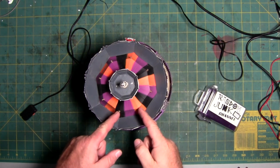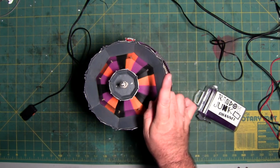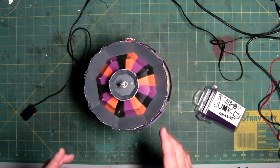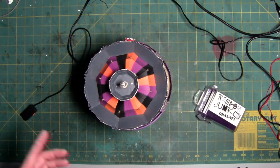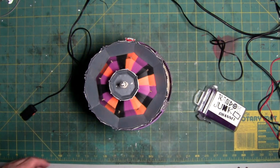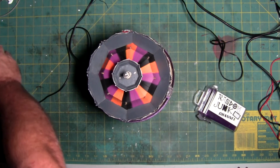These lights have been replaced. These are backlit, like fiber optic. There's LEDs glued to the backs of these. And this is a plastic stem that they then wrapped a little piece of wire around to make it look remote. So they are dimmer than the rest, but they are on. It's just using it as a fiber optic where you have the light on one side and a clear piece of acrylic going through it. So this is as good as I can get it for something that caught fire, basically.